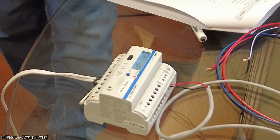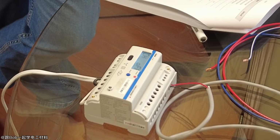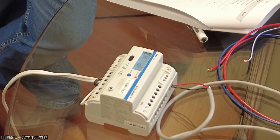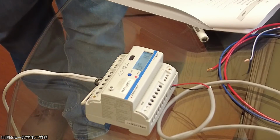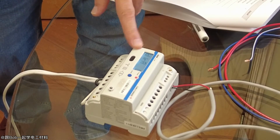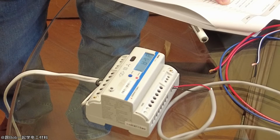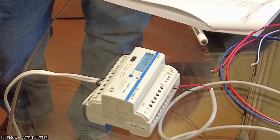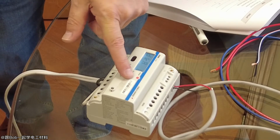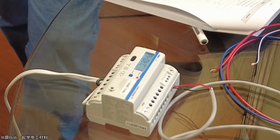When you wire this up, generally it's a little awkward to use, to be honest. But you can set that on, and it'll tell you if you have a CT in backwards or not. Okay, so you either turn that on or you turn it off. And if that's on, the next one will tell you the direction of the A input, which is your current input 1, whether it's 0 or 1, whether it's positive or negative. Okay, so again, if it's negative, that means it's reversed. And that's basically all of the parameters on that.